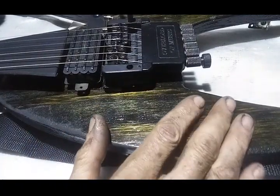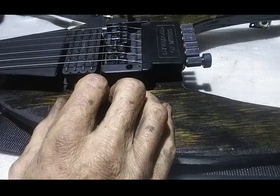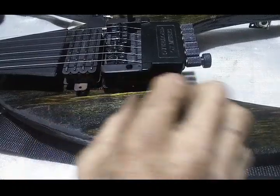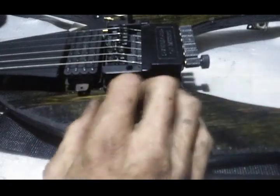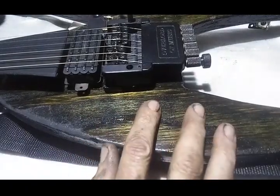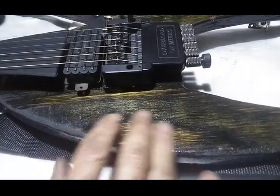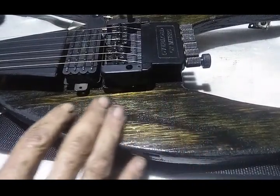If you had wood sanded very smooth — at least 320 if not more — I think how smooth your wood is determines how smooth the poured-on product is going to end up. You can see the difference here. You would sand it very smooth, pop the grain and sand that back, then seal it, knock down any fuzz or grain pop, and once it's nice and smooth and sealed, you could pour this stuff on and probably get a pretty close-to-glass finish in one shot.